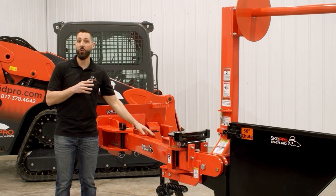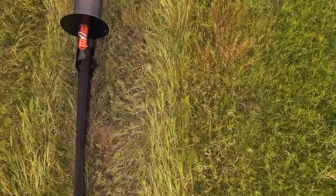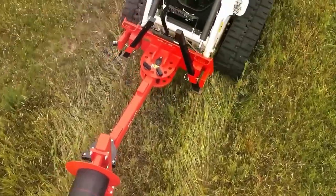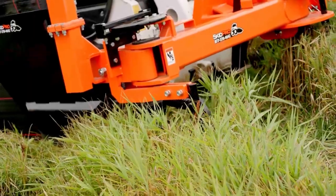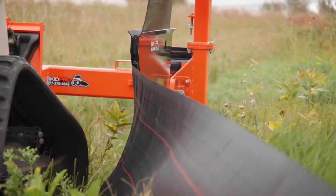The offset will be 24 or 42 inches from center when you're in the pull position. This silt fence plow can install fence between 6 all the way to 20 inches deep, though depth is usually specced out and oftentimes in the 8 to 10-inch ballpark.